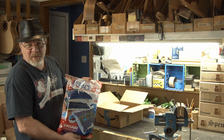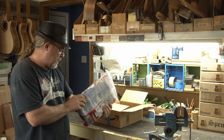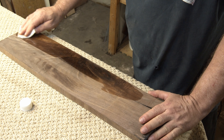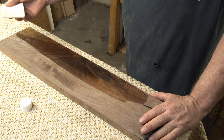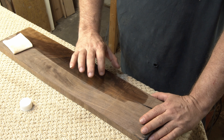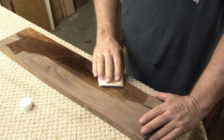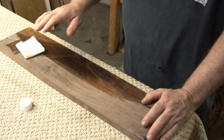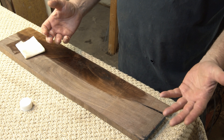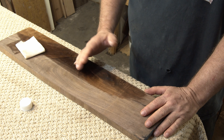I have space saver bags — you know, those vacuum bags — because we are going to try and experiment with the fretboard. I found this beautiful little piece of walnut kicking around in the shop. Walnut is not the most dense wood and I'm worried the frets over time are going to loosen and come out. I recently saw another guy at Crimson Guitars doing a fretboard where they soak it in resin in a vacuum, and that resin gets pulled down into the pores and makes the wood much harder and stabilizes it.